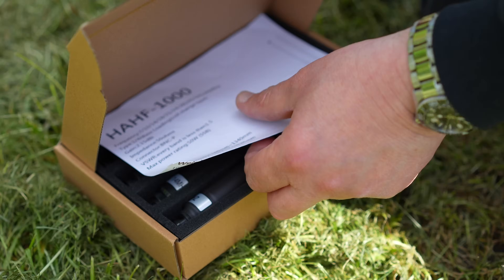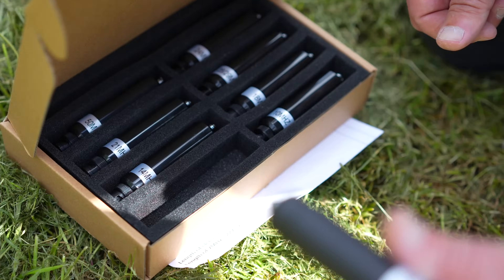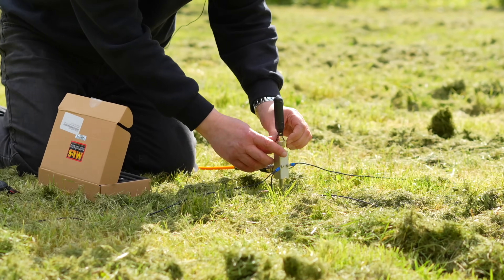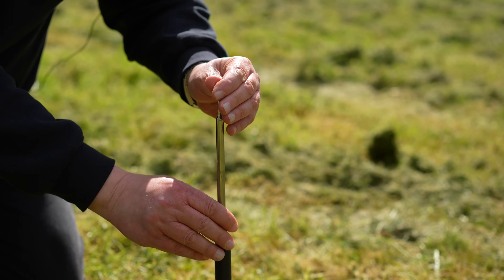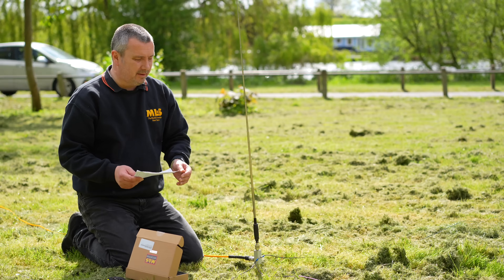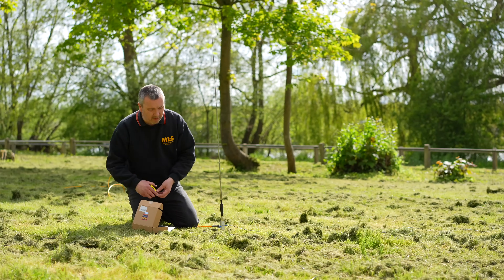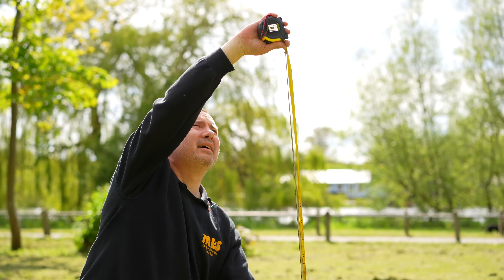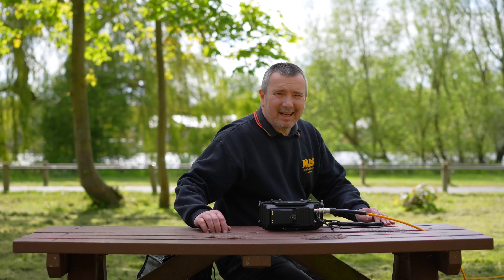Here's the antenna — we'll have a look at the instructions in a moment. We're going to have a go on the 40-meter band, so we use the 40-meter coil. We'll connect the adapter, pop it onto the ground spike, and add the telescopic whip. We'll extend it fully, then check the instruction leaflet, which tells us what length to set the telescopic whip for any given band. On 7 MHz it says element length 1155 millimeters, so I've got my tape measure and I'll set it up — there we go, that's just about 1155mm.